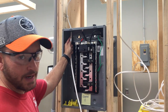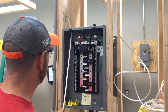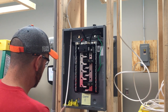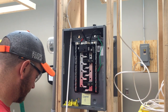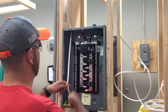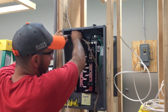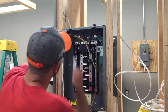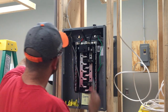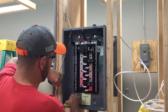They make Romex rippers that a lot of people like, but I'm going to use a box cutter utility knife today. We're going to come in from the top and lightly score the sheathing — the more you do this the better you'll get at it. At the very bottom give it a good push, then along that score line, even with a dull blade, it will rip along for you. Bring it up to the top, then use your utility knife to cut this out and remove the protective paper.